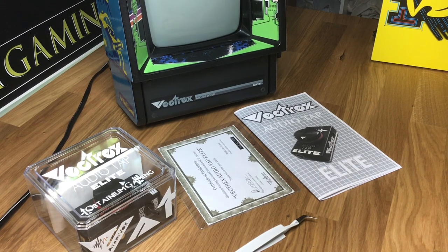Now some of you tuning in here on my channel might be wondering: what the heck is the AudioTap and what does it do? Well, the Vectrex was actually capable of three-channel stereo, just like keyboards that Casio and a few other people made. Some computers back then were capable of it too, using the same chip — the General Instruments chip sound generator — and I wanted to exploit that so people could enjoy what the Vectrex really had to offer. It's way, way, way better when you can do it.